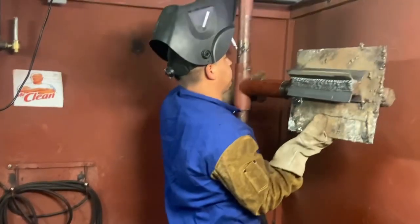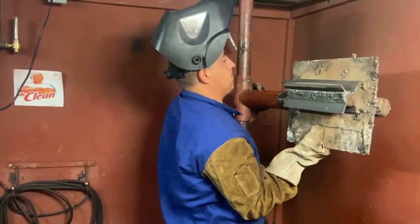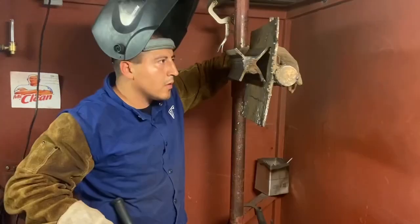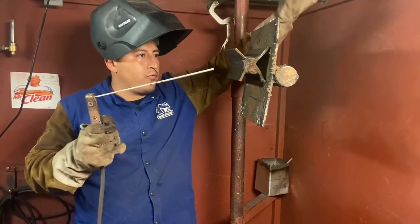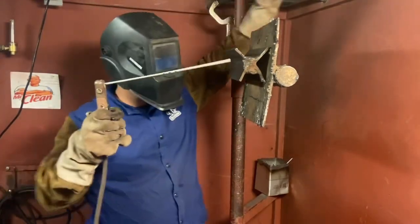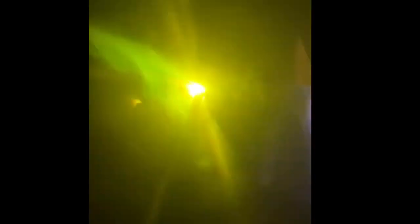The first thing I do is always adjust my work piece to where I'm going to be comfortable welding, then I observe it — I stare at it and see what I'm going to do first. I prop my electrode, do a couple of air runs, see how my breath is going to affect my movement. Once I feel comfortable, I wrap my hand around it, hugging it, simulating it as a pipe. I weld from the electrode going away to close to me, like a pipe — that's how I've been taught here in the weld program in Texas.